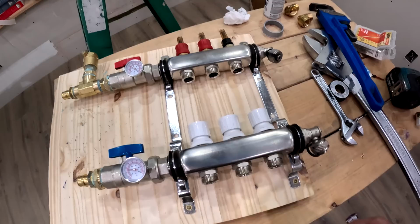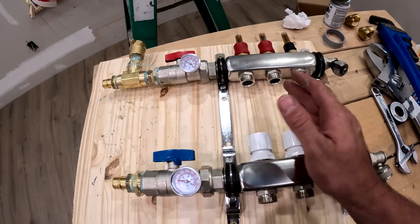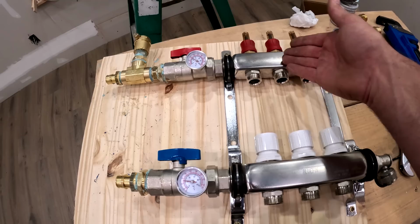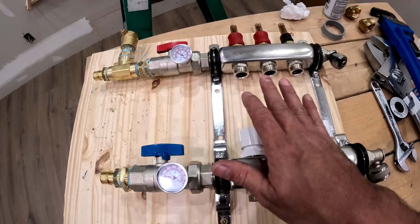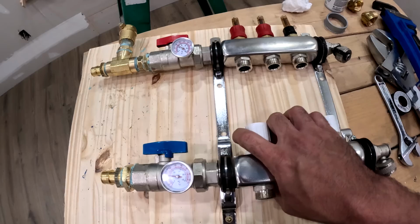Because the deal is you can either insulate tight to it, or as long as the space around it is insulated and it gets conditioned, which means, like, if I got cold running in these pipes and I got this whole thing boxed off with insulation, well, the air inside of that little area is going to be cold and conditioned, so it won't condensate. So rather than wrap everything tight and not have access to anything, I'll just make like a little chilled box for it.